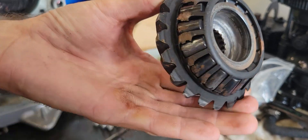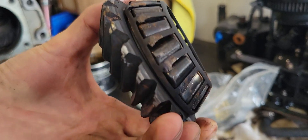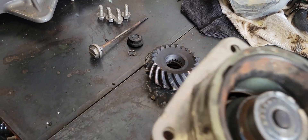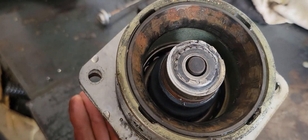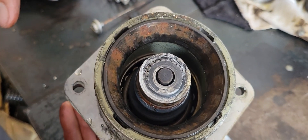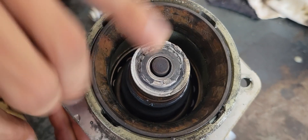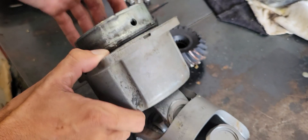Not just that — if you spin it, you can see how the bearing race has gotten hot. You can't smell it on video, but it smells like burning. Looking on the inside, it's not supposed to look like that at all — there's damage all in here. The gear is splined onto that shaft and it's now fused itself. And this bolt, which you use to set the rolling torque and bearing tension, has sheared off and been chewed up on the inside.